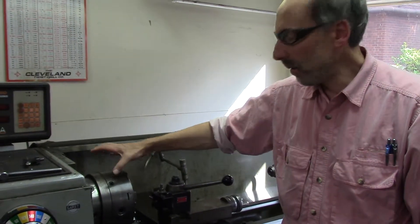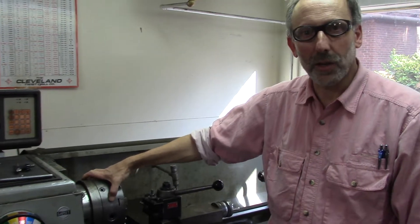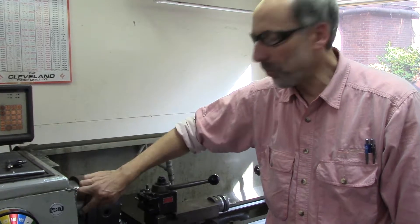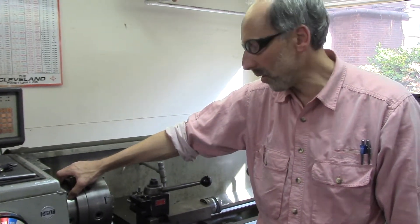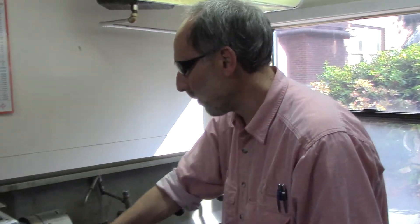The work is moving plus this is moving. This chuck weighs over 60-70 kilos and it's held on in six points, and these points need to be verified as secure before each and every use. So you identify the locked position on each of these before use.